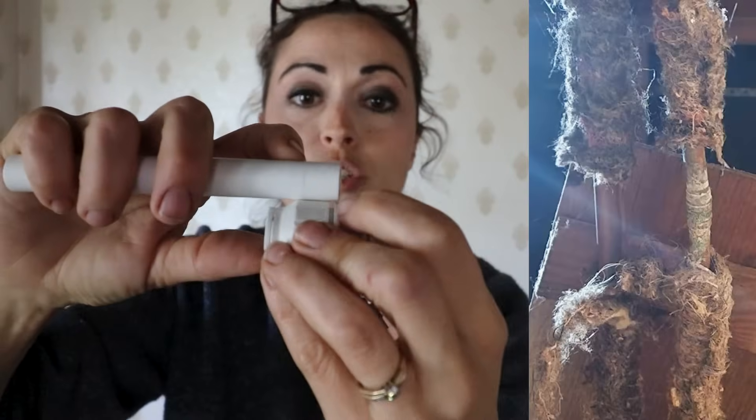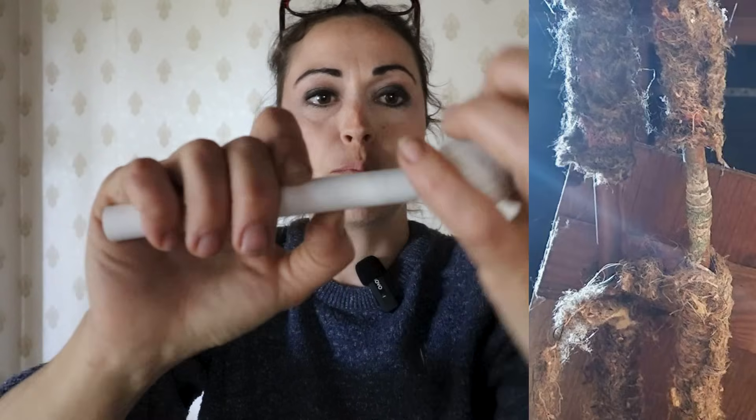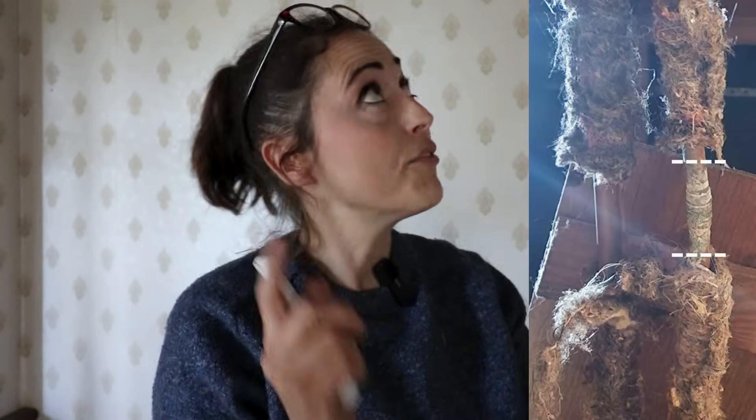I've got all the bits here. I'll show you how I set this up, put the water back on, test it, and hopefully there are no more leaks. I need to be careful not to disturb the rest of the plumbing — if I start tugging at stuff I could create another weakness at another join, and one job could turn into three, four or five. Looking at the copper pipe, it goes almost to the halfway point, so I need just over an inch. I don't think I've got enough to play with by the time I cut either end, so that's why I've got a little piece of 15mm pipe.